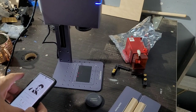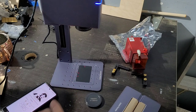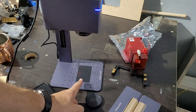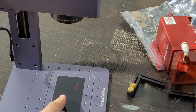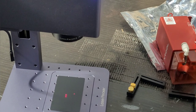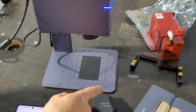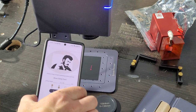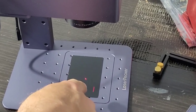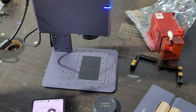There's a preview function in the app that turns the laser on. You have two lasers — one here and another coming through the lens. You adjust focus by dropping the laser head down until those two beams line up and become one — now you're in focus. That focus distance happens to be 130 millimeters. They include a wooden ruler, but aligning the two beams is your go-to focusing method. The preview then shows you exactly where your image will be engraved, either as a path trace in G-code mode or as a bounding square.